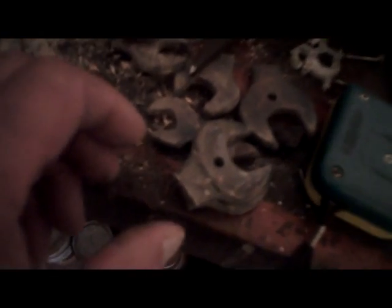So I thought, well, I've got to anneal them. I know I have. I've got to soften them. So I've got a little blow lamp, which wouldn't be hot enough, of course. So what I did, I found a bag of charcoal in this shed from before. So I put it in a tray, a bit like a disposable barbecue, I suppose. And I did them, and it took a long while. Anyway, it's worked. I've just done these 3, and that's worked alright.